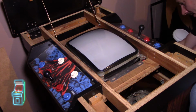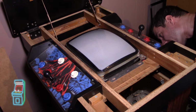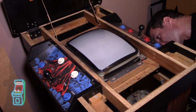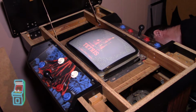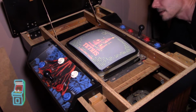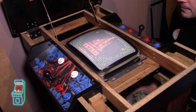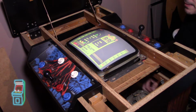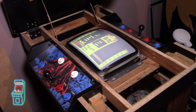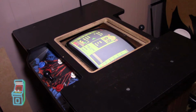And fingers crossed, let's turn it on. See what happens. Hopefully no smoke comes out. And we'll see something here. Keeping an eye on down here, so no smoke. And there it is. So now I'm going to wiggle that connector. And it's fixed. Awesome. I was wiggling it and it was moving before and now it's rock solid. So I was right when I said I needed to reflow that. I was a little worried that it wasn't going to fix the problem.